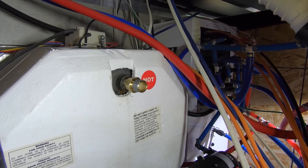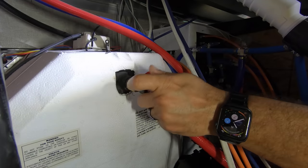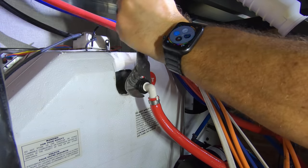Next up is a check valve. You might have seen our recent video where our check valve broke off the back of our water heater — it was plastic, and that is going to break. The way those RVs bounce around, that plastic check valve will break eventually. So have one of these on hand. You might want to swap yours out preemptively. When we swapped ours with a brass one, I ordered two because I want a spare just in case.